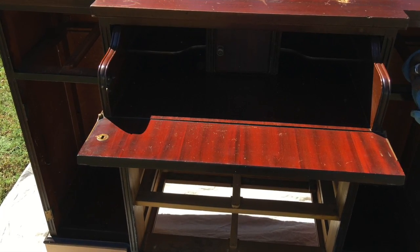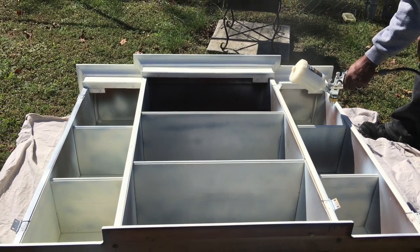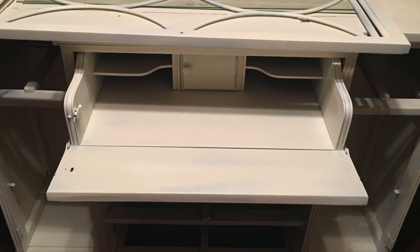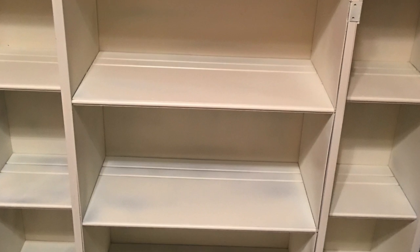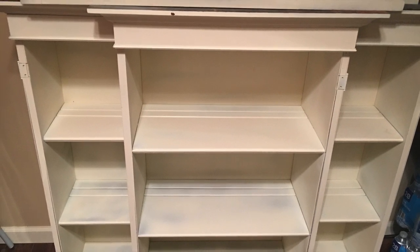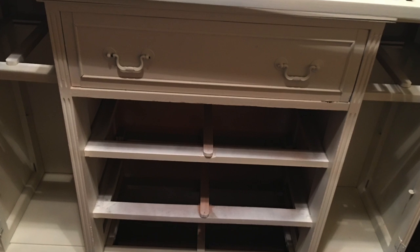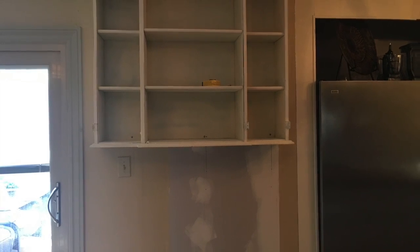So we took the piece outside, wiped it down, and my husband did a deglossing on it, and we began to paint. We used a Valspar paint with primer in it — not a special paint, just an off-white, creamy off-white color that happens to be the same sample I keep taking back to Lowe's repeatedly that matched our cabinets. I don't have the name of it, but if I can find it I'll put it down below. Even though we'll start off with a sprayer, I almost always finish up with a brush and/or roller, as I did with this. It perfectly matches the kitchen cabinets.